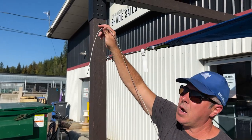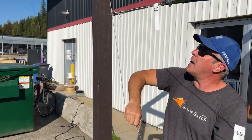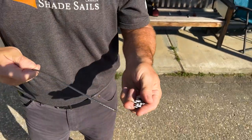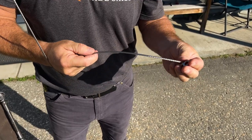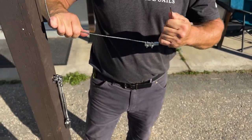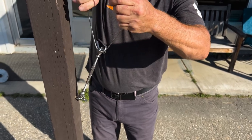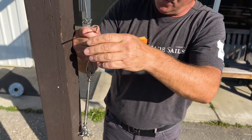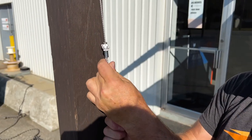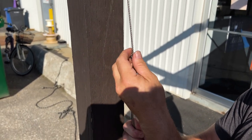We're going to thread our piece of cable through our eyes to finish our two-sided cable system. You've been given important little hardware: you've got two cable clamps and a swage — that's a spacer. First, put on your cable clamps. The spacer is a little feature so that when you go against your thimble it pushes the cable clamps, allowing you to get them nice and close and tight. That goes over your thimble. I've got my hardware set up and ready to tighten. I'm putting the clamps over the top of my second piece of cable so I can get this nice and snug and tighten it up.